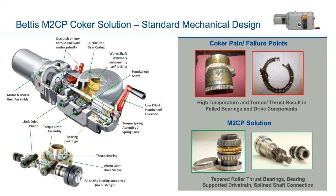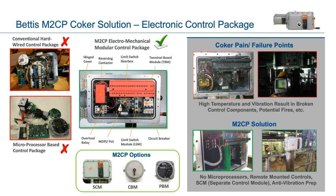The modular control package of the M2CP incorporates plug-in printed circuit board technology, which minimizes wiring and allows for ease of service, modification, or complete removal using a common screwdriver. Unlike many newer and more advanced electronic actuator designs, this solution has no microprocessor components, which are susceptible to premature failure in severe services. Instead, it incorporates reliable circuit boards with no termination wiring, and compact internal limit switches and relays that can withstand the high temperatures encountered in a delayed coking unit. The M2CP electrical control package and components can withstand the vibration and violent shaking of the actuator during the coking process, with smaller mass components such as limit switches resisting self-destruction from inertia and momentum. The electronic enclosure is a robust marine-grade aluminum design with a hinged cover and stainless steel-captured bolting, protected by a polyester powder coating for superior corrosion resistance.